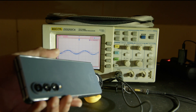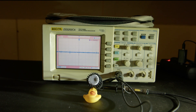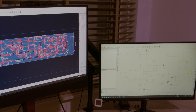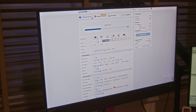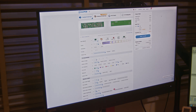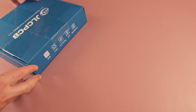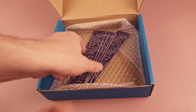You generally don't need phantom power to use dynamic microphone capsules. However, the sound signal from this capsule is very weak, so we need to build a preamp circuitry to make it usable. To amplify the sound signals coming from the capsule, I designed a preamp circuitry in KiCad. I plan to place the PCB inside the microphone so I won't need to carry an external preamp. Once my design was complete, I ordered the PCBs from JLCPCB. If you want to make the same circuit, you can simply upload the Gerber files to their website. You can find these files in the production folder under the GitHub link provided in the description. Ordering 5 boards cost me around $2. I only changed the color to purple for aesthetic reasons — you can choose any color you'd like.